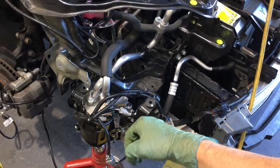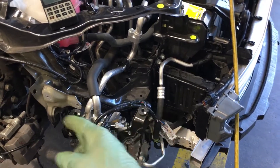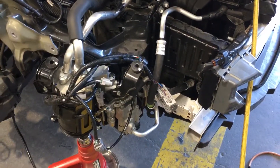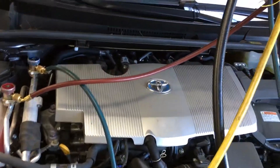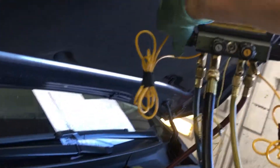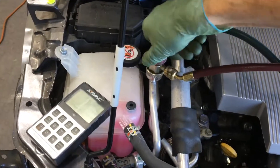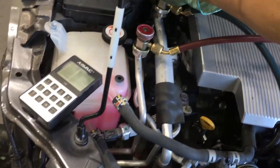Now when the technician opens any of these screws, dry nitrogen will be coming out under very low pressure — but moist air will not be sucked back in. I gave them very detailed, specific instructions: every line goes up, put a rubber plug inside, put a plastic plug inside. Take it like your life depended on it — because the customer's compressor depends on it. It's not immediate damage; it's like a ticking time bomb that happens over a period of time. Now I can shut everything down. My gauges are filled with dry nitrogen, and the system is ready to be disassembled and serviced.